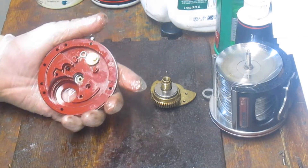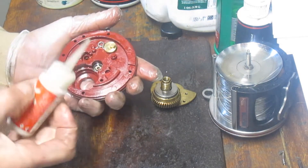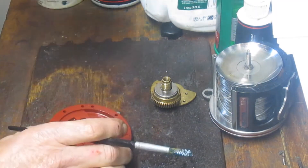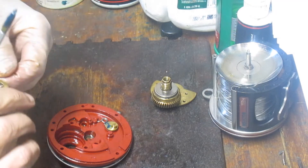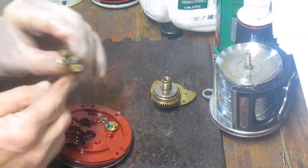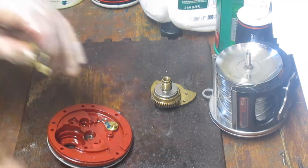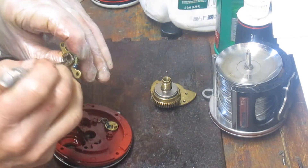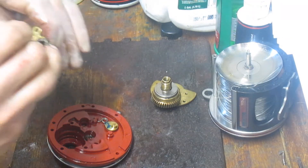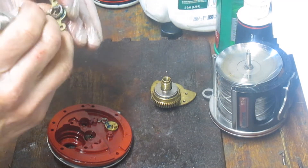We've cleaned up the case. There's a little oil in the back — we're going to do the same thing on this bearing that we did on the other one and flood that bearing. Grab a little bit more grease for the eccentric, then reinstall. We're going to come back to the yoke, which we cleaned — make sure we get some grease on each side of it. We'll grab the pinion gear, which we cleaned. There's a little bit of a buildup where the spool is going to mesh, so let's make sure we get that out too with the pick. Pretty much clean there now.